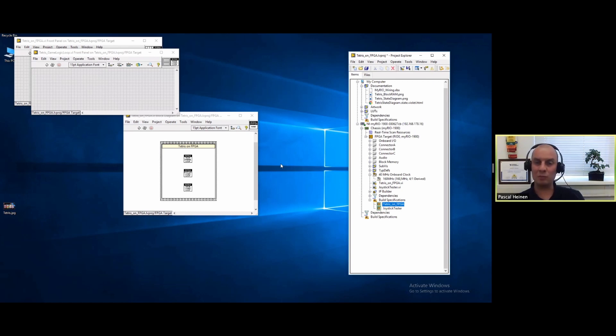If you go to the snake blog in the description and the VI Technologies website, go to the blog and Snake on FPGA - you'll find the VIs needed for generating an 800x600 signal and can concentrate on the logic for whatever you want to display. I'm also looking into a library where you can visualize the voltage on an analog input or monitor digital outputs - you can use this library in your projects to debug the FPGA without influencing the RT or setting up a data stream. You only need at least three digital outputs: horizontal sync, vertical sync, and one pixel color.